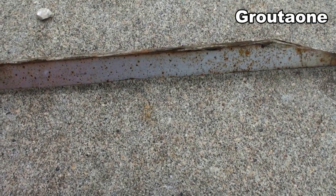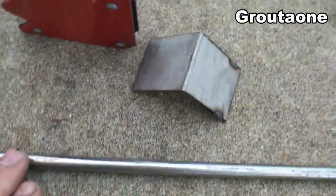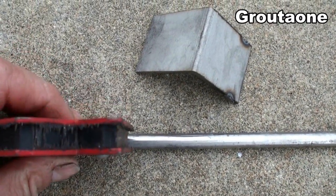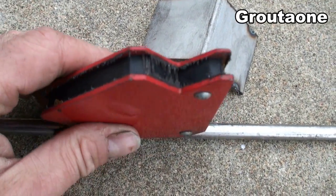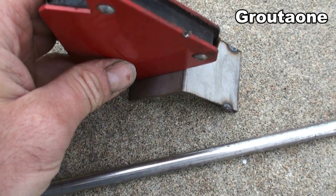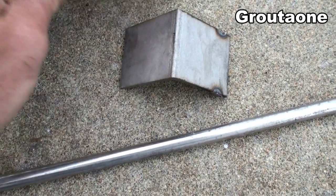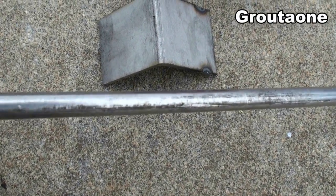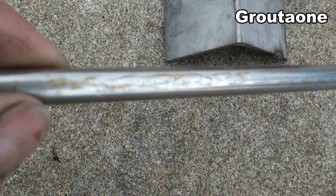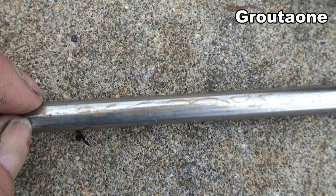If you're looking for a high-end stainless, you're going to be in the 300 series, which is probably what this rod is. I'm not sure — I just bought stainless rod, they just gave it to me, I don't know what series. But you see the magnet doesn't stick to it. The magnet test on stainless is always a good indication of what you're getting. And if you look close on this you can actually see a bit of rusting on it.